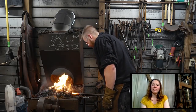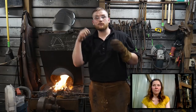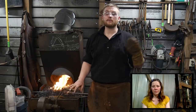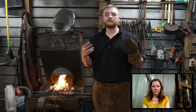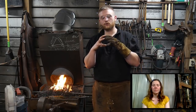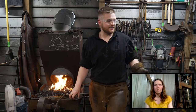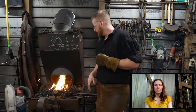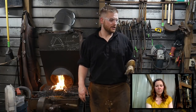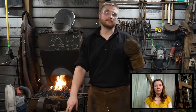George Hughes asks: is it best to use the anvil horn to taper rather than the flat face? It's really just preference. You can use the anvil horn — some anvil horns are not very well supported. Some are made out of cast iron, some are just soft wrought iron on really old anvils, and you'll wear a little U-shaped spot on them. The horn and the flat face serve two different purposes. The fattest part of the horn is just a big fuller or radius to help draw out material and reduce surface area contact — you'd want to use that to move a lot of material. The flat face is where you do most of your cleanup work. In the type of smithing I get into — lockwork — you don't use the horn very often at all. So that's just something to consider — it's different for everyone.